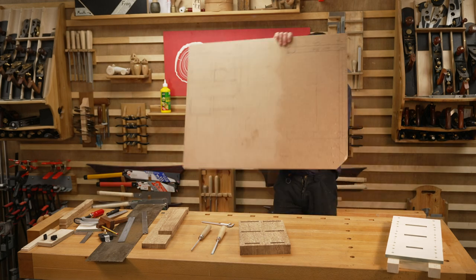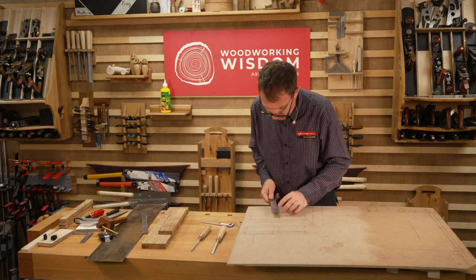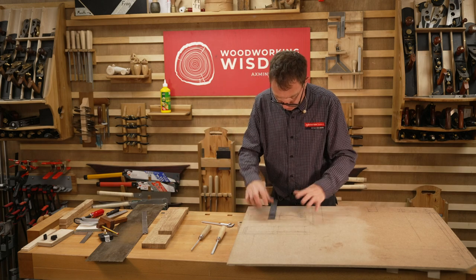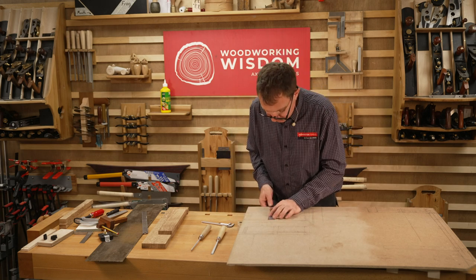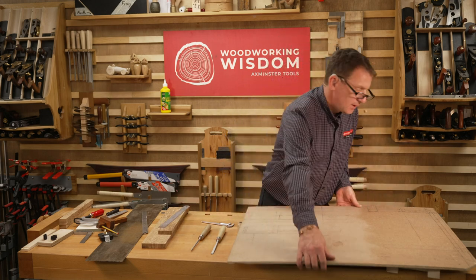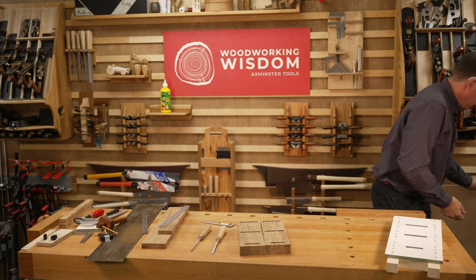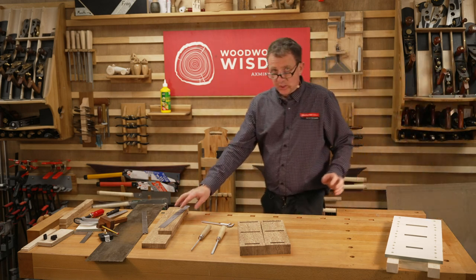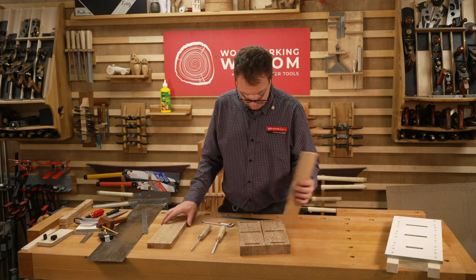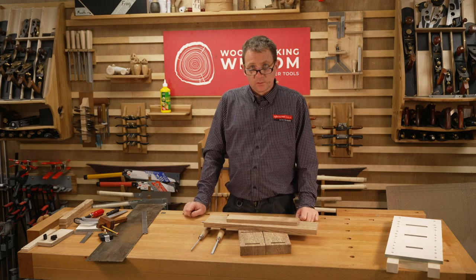Nice round number. Back to the drawing, because I need to measure the width of the front panel, the width of where the clock faces are, to get that rail length. So we've got 120 plus 11 and 11, 142. So my next task is going to cut my rails. This is bottom one and top to 142 long. So I'll go cut those.